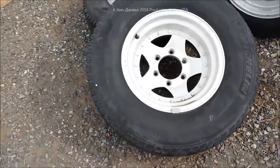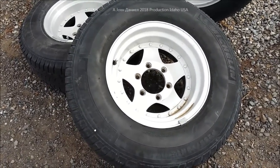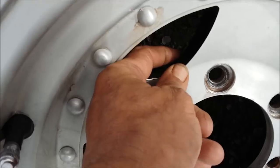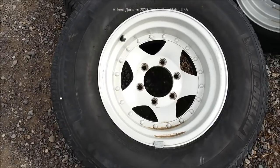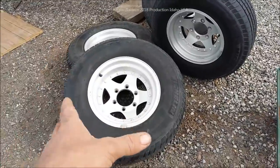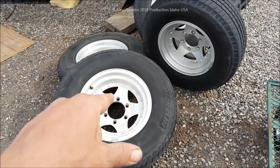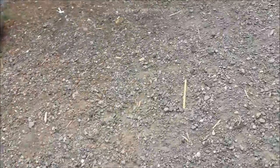These wheels were on an older Chevrolet van, so they'll work fine. They actually have extremely thick aluminum, very thick, and these will work fine. They are a 6,600 pound limit per axle, and we're working with 6,000 pound axles. So these came off of a 3/4 ton Happy Time cruiser van, and that was the older 3/4 ton Chevrolet. The new ones I believe are now 8 lug. So some of them, not all of them, are 8 lug, but most of them. It's called a heavy half ton. So let's get over here and I'll show you this.